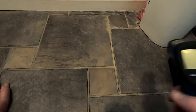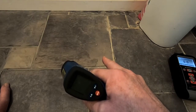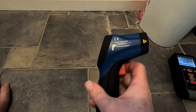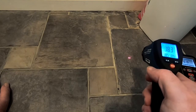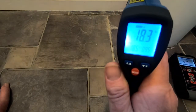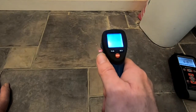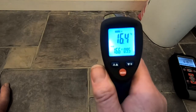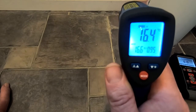Where we've just got a positive reading for potential moisture content beneath that tile, we can also measure the surface temperature using this infrared thermometer. The control reading from the unaffected tile is currently reading 18.3°C, so an unaffected tile is 18.3°C.